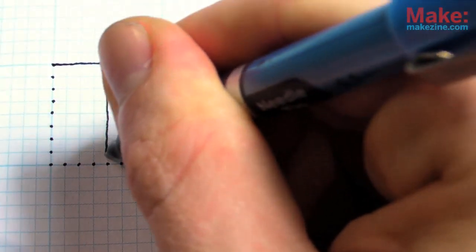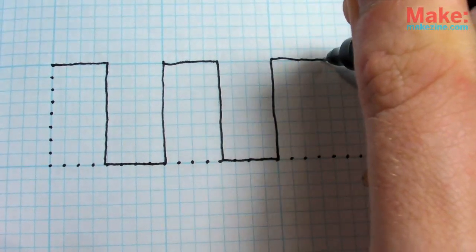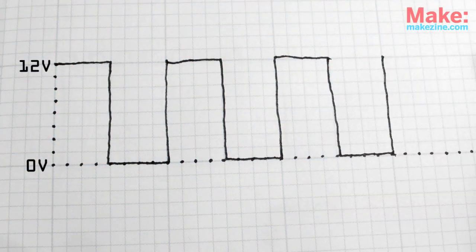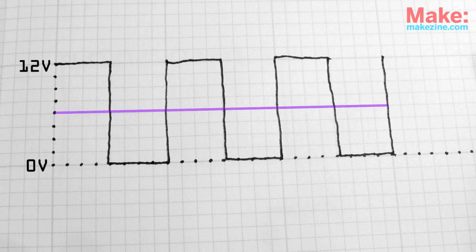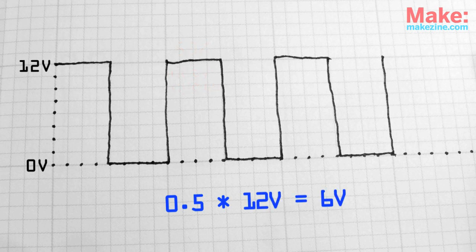Instead, I can supply full power to the motor, but just in short pulses. A motor takes a little bit of time to respond to abrupt changes, so by powering it with a pulse wave that switches between 0 and 12 volts at a fast rate, our motor will behave as if it's getting a steady voltage somewhere between 0 and 12 volts. We can determine that voltage level by taking the amount of time our pulse wave is on versus off — this is known as a wave's duty cycle. We then multiply that amount by our pulse's high level, so our signal has an average of 6 volts.